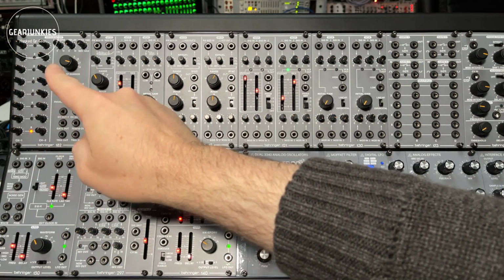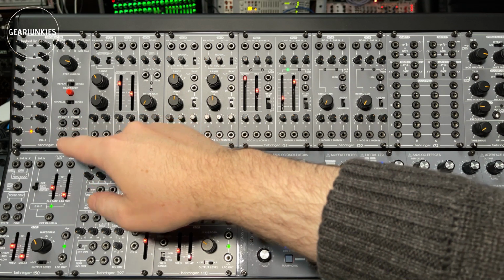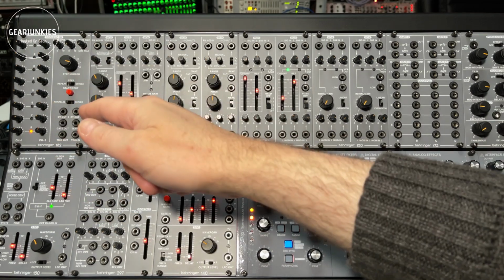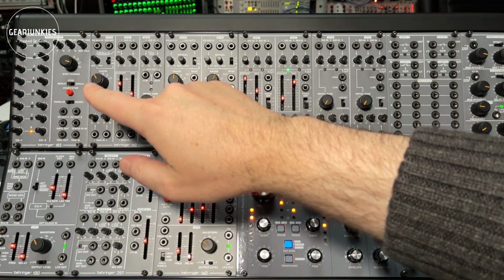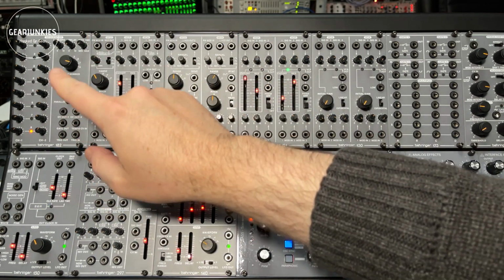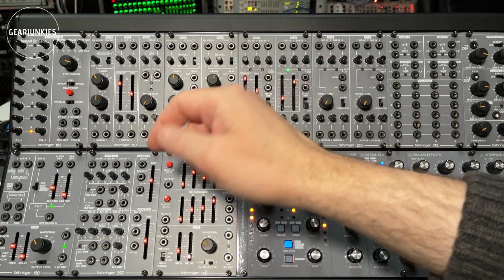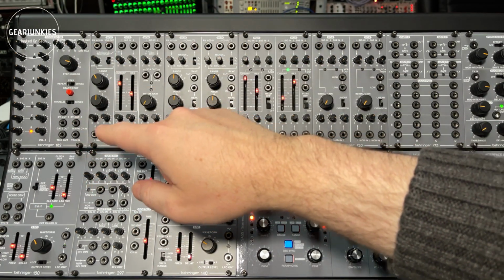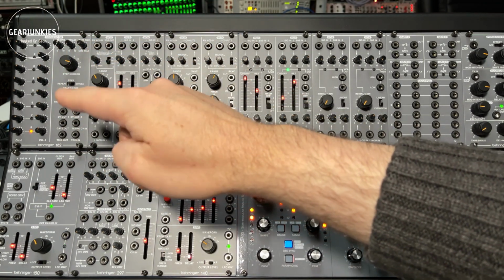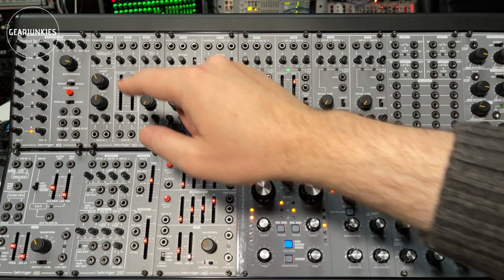It has three modes: repeat, where it continuously runs through the sequence; step, where it steps when there's a trigger in; and single, where you just press a button and it plays a single note. The last mode is very handy if you want to tune it, because it doesn't have any quantizing. You will need to adjust all the notes manually, for instance by using a tuner or by ear. So you can go through all the rows with the start-stop button and listen to individual settings of the pots here. Then there's the tempo pot, a delay, and a gate time.